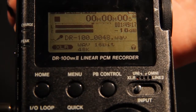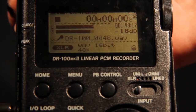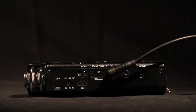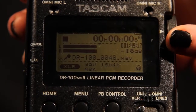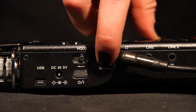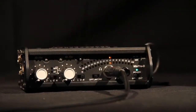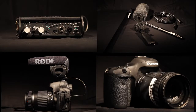Before recording, you should ensure that 30 seconds of tone is recorded so that post-production can easily tell what level the sound is supposed to be. Connect the right angled mini jack on the left hand side of the recorder into the headphones. Using the wheels on the side of the recorder, adjust the incoming tone to minus 18 decibels. To listen from the recorder, press the return button on the MixPre-D. Listen between the mix and recorder whilst adjusting the Tascam's headphone volume wheel until it's the same volume as the mixer. Turn the tone off and check the playback via the recorder. Now you have set up all the equipment you need to shoot and record audio.